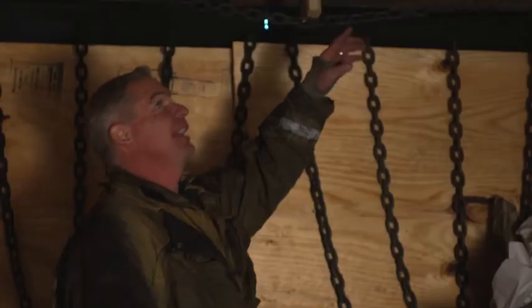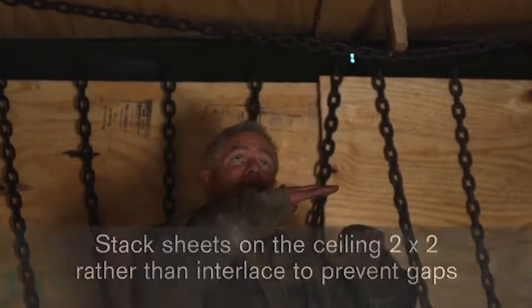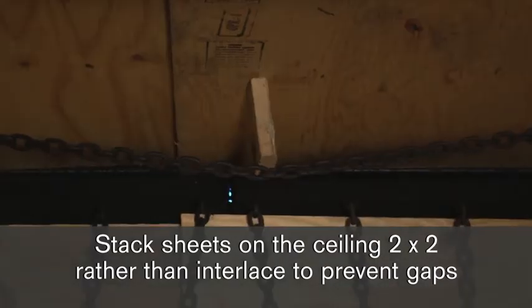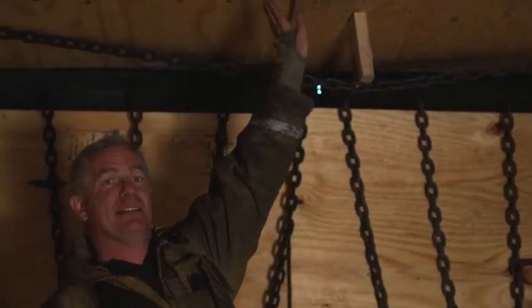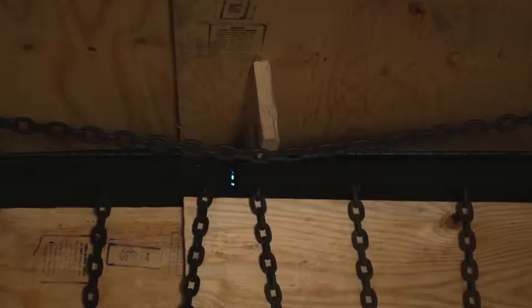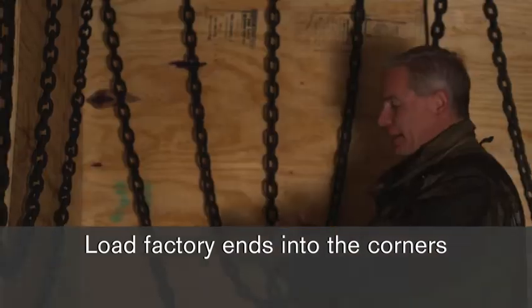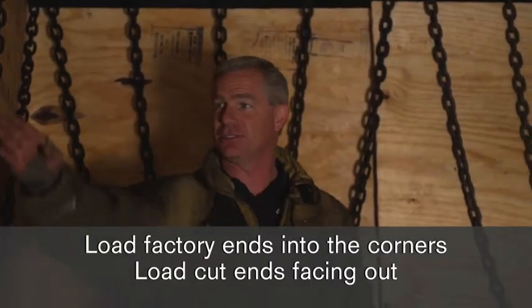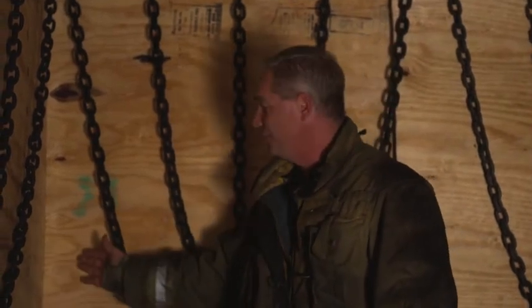That goes for the ceiling as well. We have four full sheets — two on one side and two on the other. We like to stack them two by two rather than interlace because it creates more of a gap between each board — and we want to prevent those gaps from occurring. We use some blocking material to force that material up against the ceiling level, because we don't want flames getting onto the upper level where we wouldn't be able to access with a hose line. We want our factory ends into the corners to make a nice tight seal, with our cut ends leading outward in the middle and on the sides. A tight factory edge will prevent fire or energy getting behind those boards.